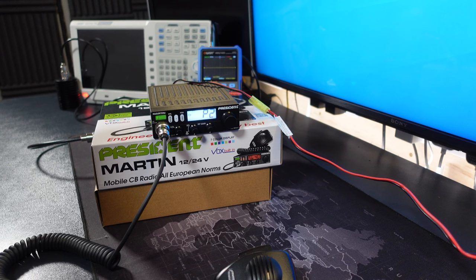We can increase this in steps and we'll go all the way up to the highest value, which is 8A. So this radio is capable of outputting 8.63 watts at its highest power output. I would like this to be 4 watts, so I will back that back down to the 4 watt mark at value 70.